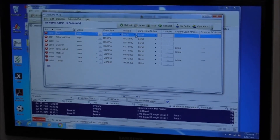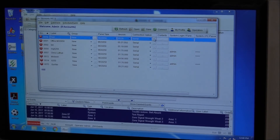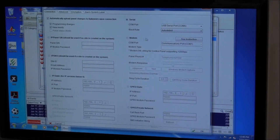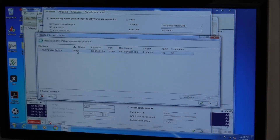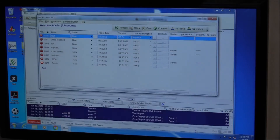I still have my test account here. I'm going to change the connection option — select this block and tell it that it's an IP static connection. From here you can search for it and double-click it to automatically detect it. The IP module password in the field is 'paradox' — small letters. Then you can connect.